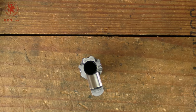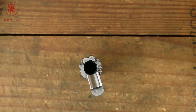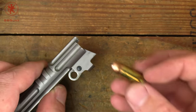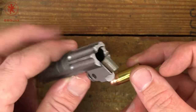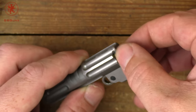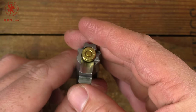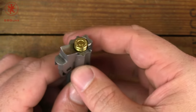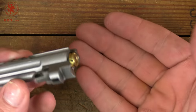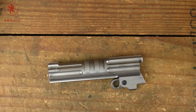Next we'll check for chamber fitment, as always using our Nosler Match — same stuff I've been using for years, though I am taking open suggestions for another current-production match-grade 9mm since Nosler is not loading this anymore. As we drop this in, we're going to listen for a plunk, see if it rotates freely — and it does. We're also taking a look at how much brass is supported. We have a little bit unsupported there, but that's still the strong part of the brass. The round drops out as it should, so it looks like a nice chamber fit.